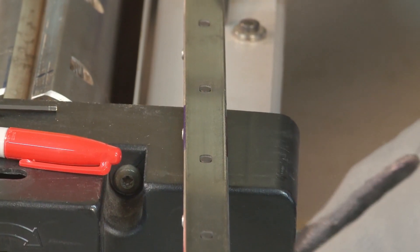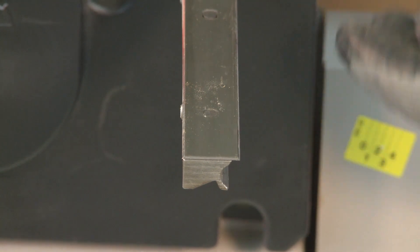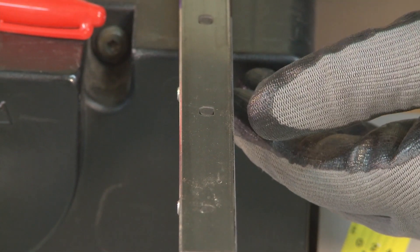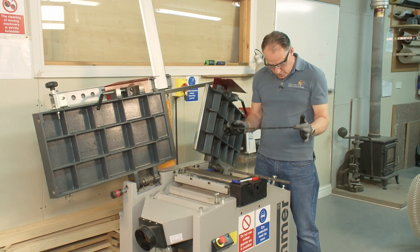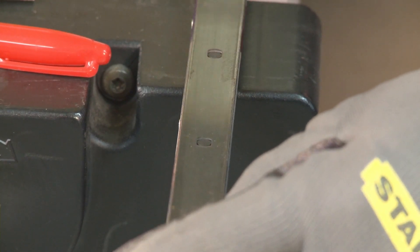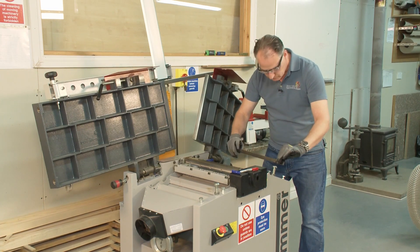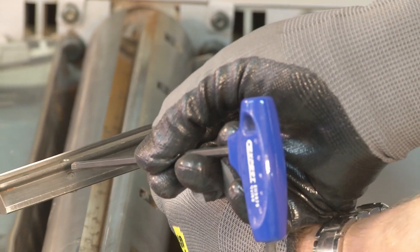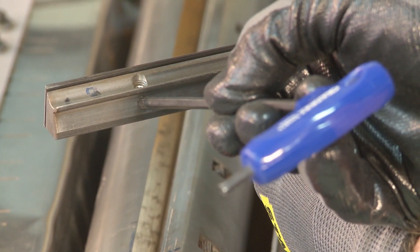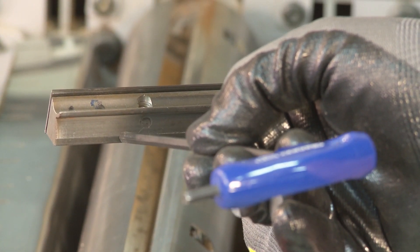This style of cutter is much, much thinner — probably only about a millimetre and a half thick, about a sixteenth of an inch. They are double-edged, so they come ground on one edge and ground on the other, and they're also held on with location pins or dowels. This means when we put a new cutter back on it goes on exactly the same place as the ones I took off. It also means these physically cannot slip off — they're not only held in by friction of tightening the grub screws, they're physically held on to the bar, and the bar is also held in with the grub screw.